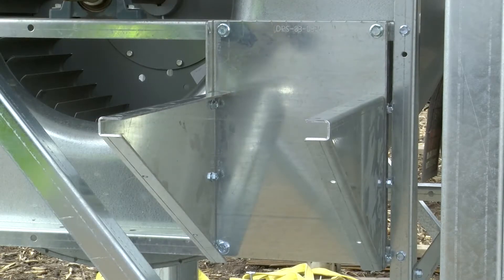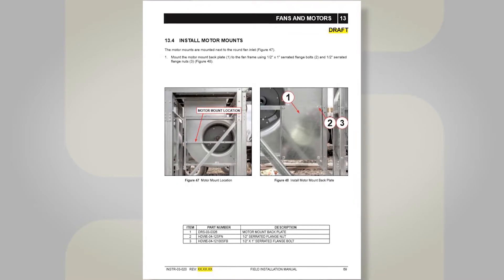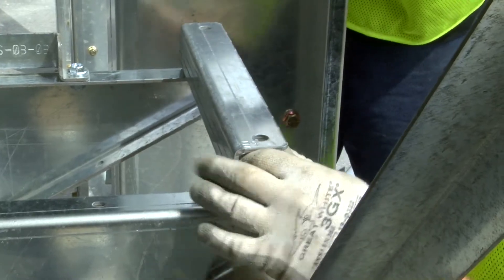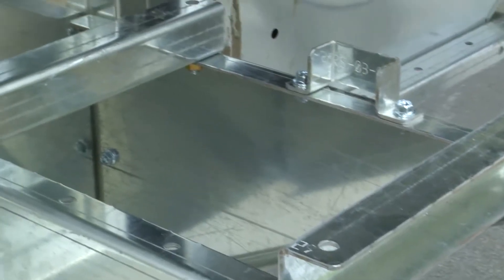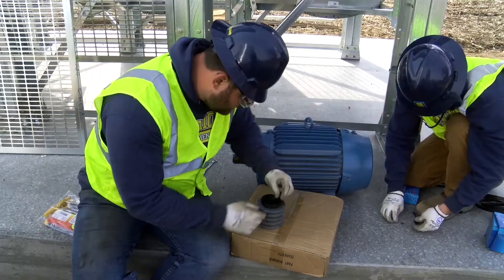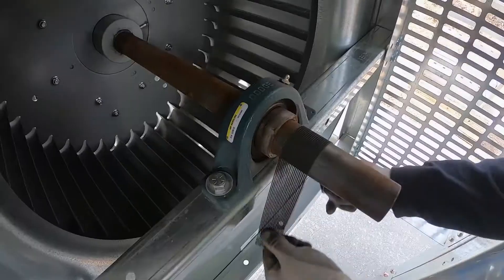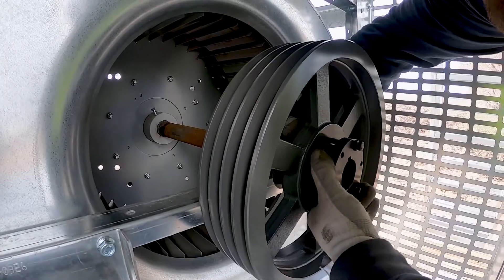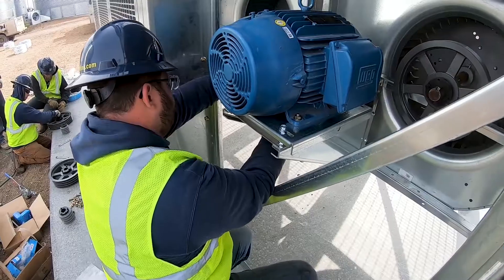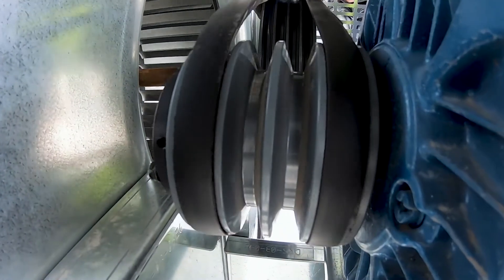Install the motor mounts as per section 13.4 in the installation manual. Note the motors will all be on one side of the dryer. Make sure when installing the motor mount standoffs to the motor mount, they are installed in the lower position for proper alignment of the belts and pulleys. Install the slide channels on the front and back of the motor mount as per section 13.4. Install the bolt stop and the motor mount motor plate. Installation of the motor pulley is easiest before the motor is set in place. Preinstall the split bushing to the pulley and line the keyway up and install the pulley onto the motor. Preinstall the split bushing to the fan pulley. Clean up the shaft on the fan with emery cloth and slide the pulley onto the fan shaft. Lift the motor into place using a come-along or a chain hoist and install the motor to the plate using the supplied hardware. Check final alignment between the two pulleys so the faces are square. Tighten the pulleys down and install the belts. Tension the motor using the tensioner bolt on the motor mount slide plate.